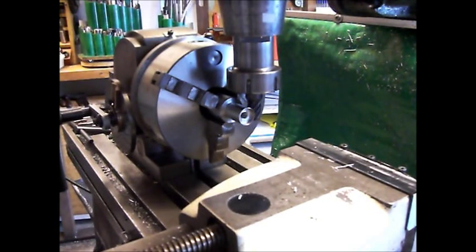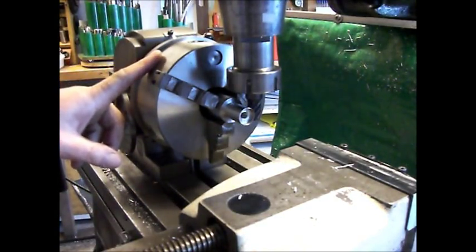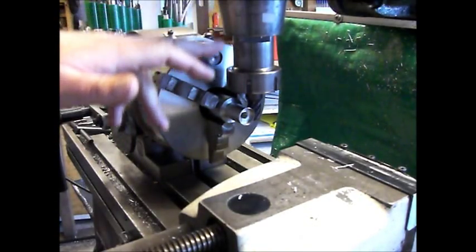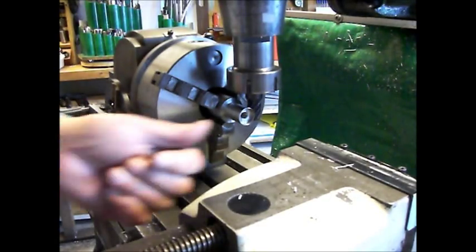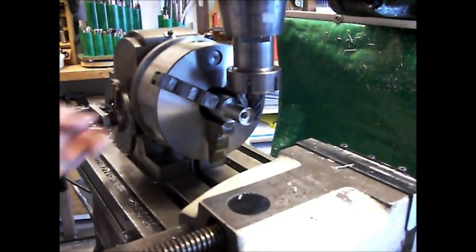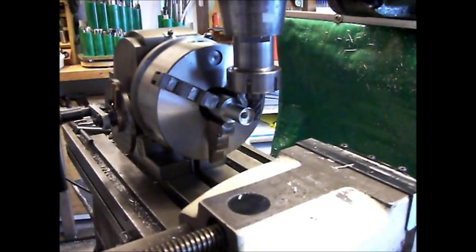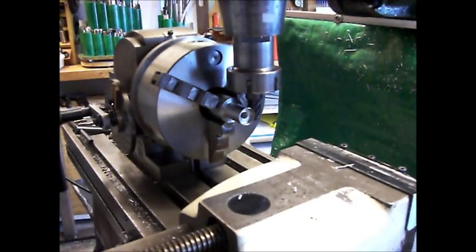Now I've set it up in the mill, in the dividing head level here, and the center of the end mill — sixteen millimeters from the end here. When I touch the surface over there, I have to go in three millimeters. Then I'll put it on the other side and do the same. Then it should be cut off and polished, and that's that.